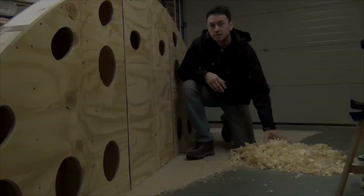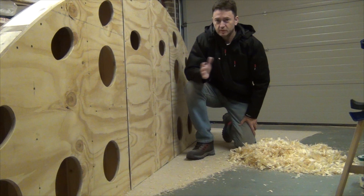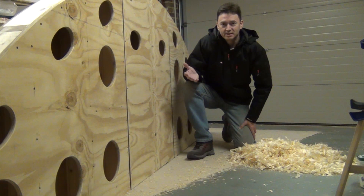After a little hand planing, the curve's lovely — all the panels nice and square and match up nicely. This is one of those occasions where in the past I promised myself to buy a compass plane whenever I want to do a curved surface. But it just happened to fall over the Christmas New Year break, so I haven't been able to get to the shops to buy one. So I've had to do it all with my number four, but actually it worked out quite well.